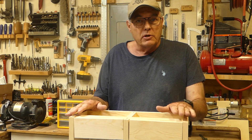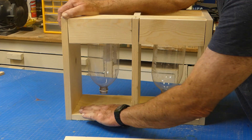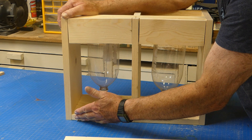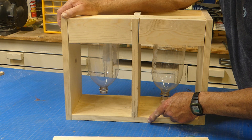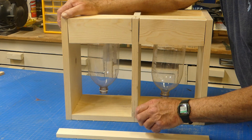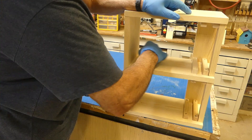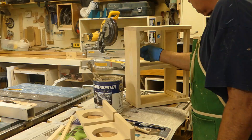There's a good reason for painting now. The seed board has a crown — the bottom is dished and the top has a slight dome or rise, so water will migrate to the outside. I want to install a series of stainless steel washers behind this to create a slot large enough for water to migrate out but not big enough for seeds to fall through. All surfaces need to be painted front and back to prevent rot. First I used denatured alcohol to remove pencil marks, applied stain-blocking primer on knot holes, puttied the screw holes, sanded everything, and painted with three coats of exterior acrylic semi-gloss enamel.